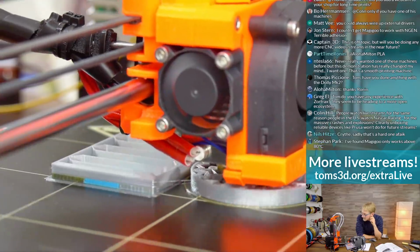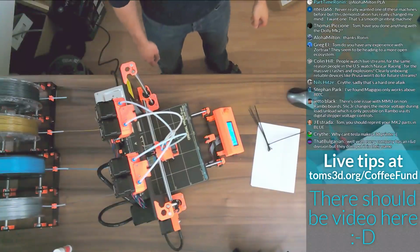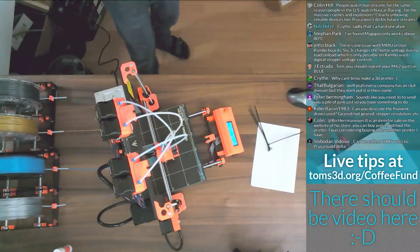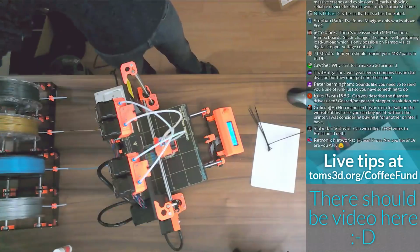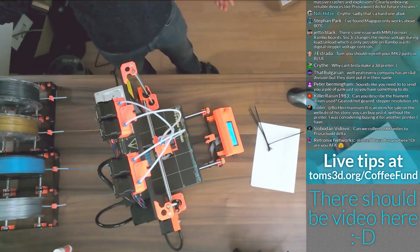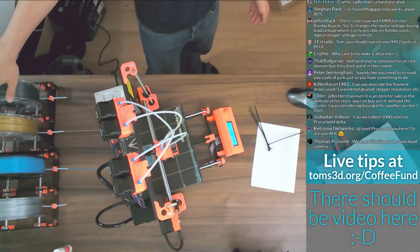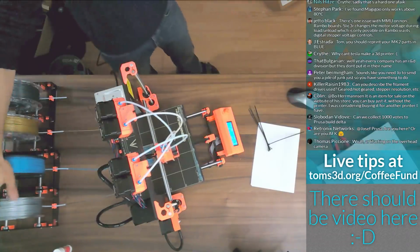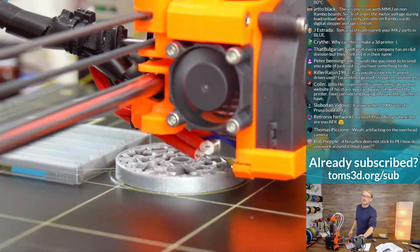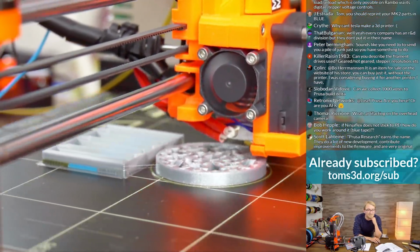It's the same as with the Filamentum colors. These also use particles. Filamentum, Rapunzel Silver, Infinity Blue, Gold Happens, and Vertigo Gray. All use particles. They're all fine to print in a standard brass nozzle. You don't need anything wear resistant for that. So perfectly fine.